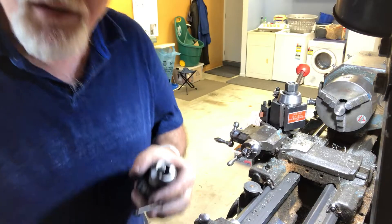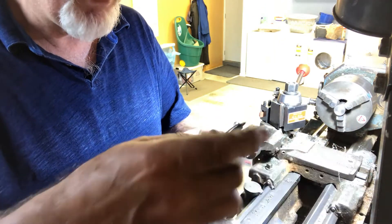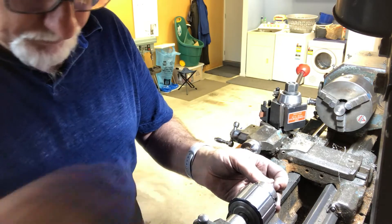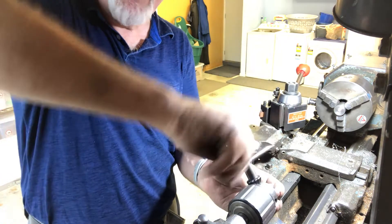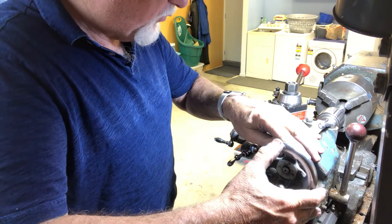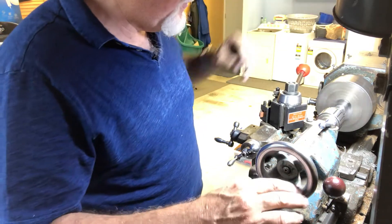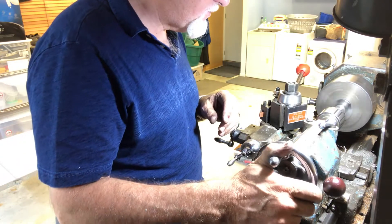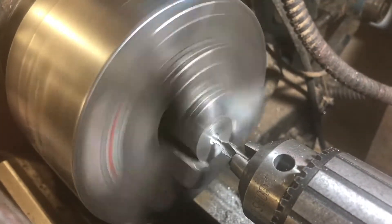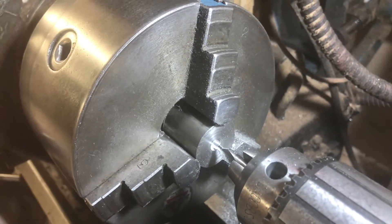The next job is to drill a hole. Before drilling, I'm going to use a centering drill, which is very rigid and doesn't wiggle around like a regular drill does — so that's very good for making a pilot hole to start the drill. I'll put the taper on the tailstock and tighten that up. I set it at half an inch, which is the starting point I use, since if you go further than that it pops the Morse taper out. So I'm just going to drill a hole there. It's made a little hole with a countersink-type taper on it, which makes it easier to get the corner of the drill in.